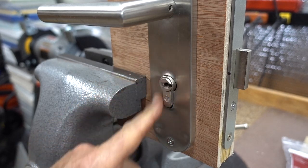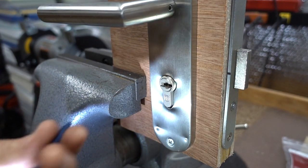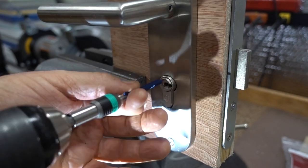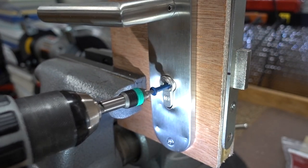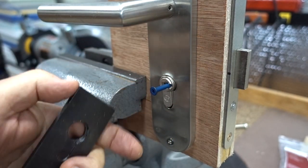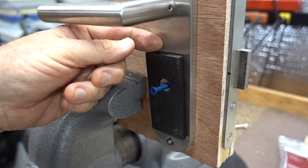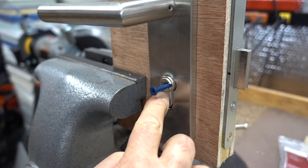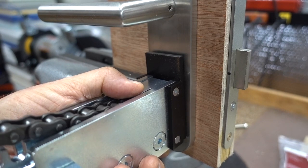I've got this little CES dimple lock installed. It normally wouldn't be sticking out this far — it doesn't really matter for this tool, but I just didn't have the correct cylinder size. I'm also not going to pre-drill this. I'm just going to take the largest one, which is the 5.5 millimeter. It is self-threading, so I'm not pre-drilling any holes. Just going to get it centered and drive this dude in there. That ought to be good enough. I'm going to take our tool and our plate.